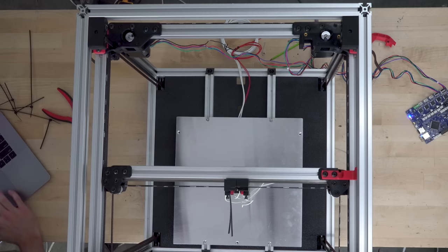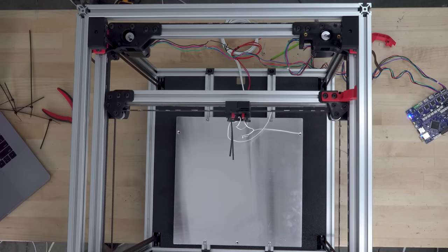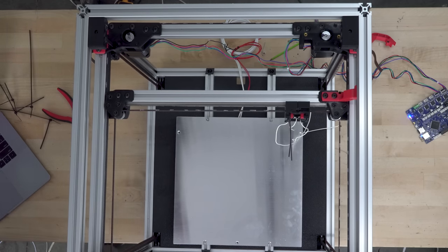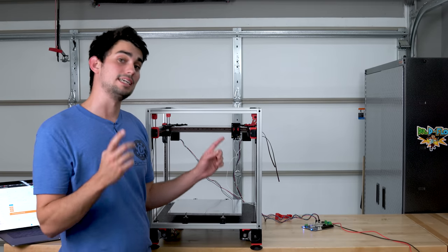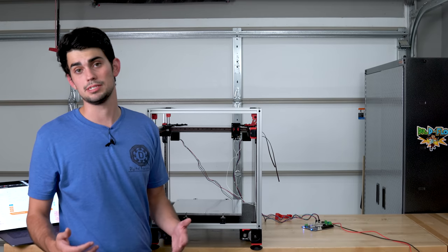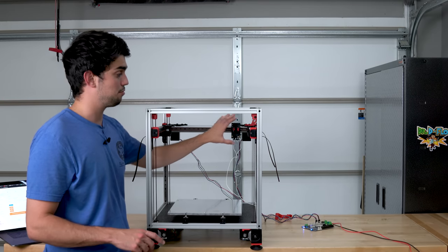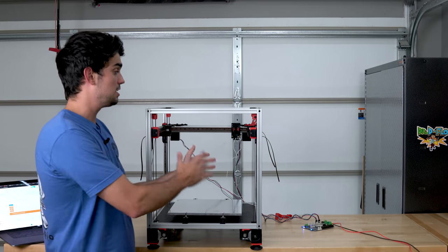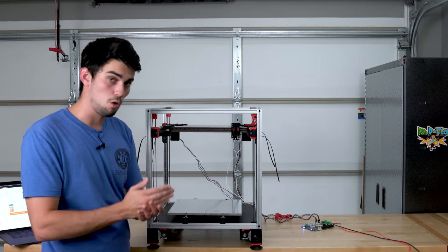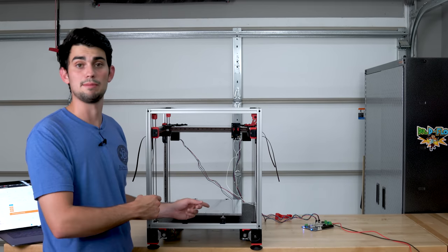But if I move in the Y direction, both motors rotate. If I move in the X direction, both motors rotate. I'm going to drop some links in the description below for those who want to take a deeper dive into the theory of CoreXY systems. But the big takeaway is that neither the A nor the B motor sit on the printhead. So there's very little inertia that has to be overcome when accelerating the extruder. CoreXY is synonymous with speed. You want fast print speeds, you want to go with this kinematic system.